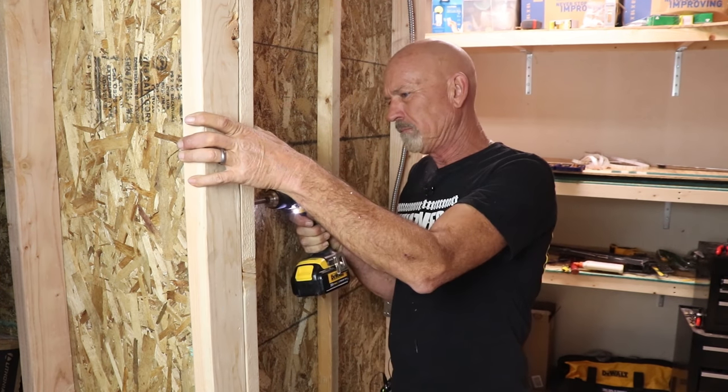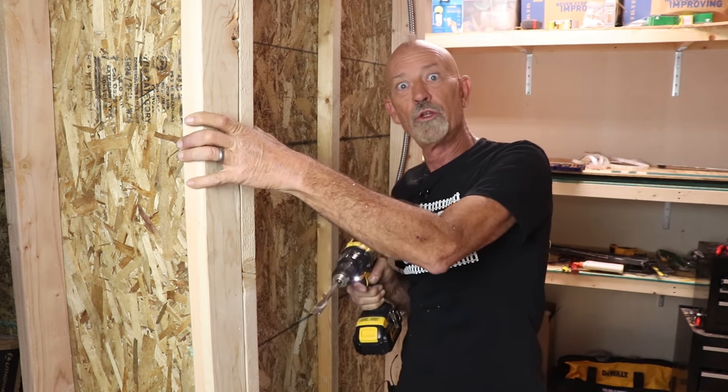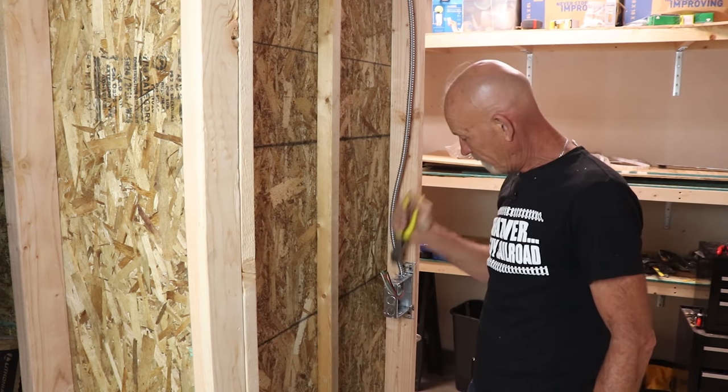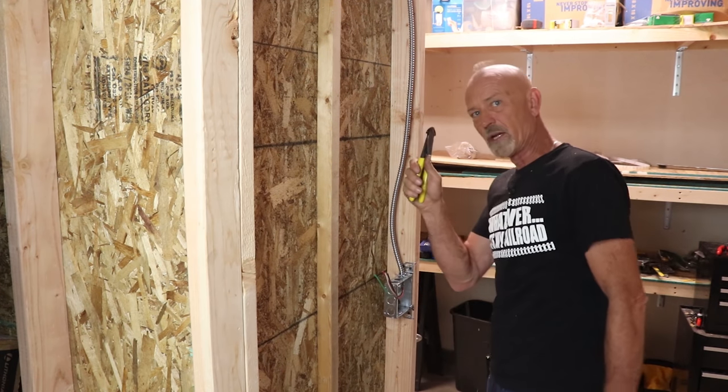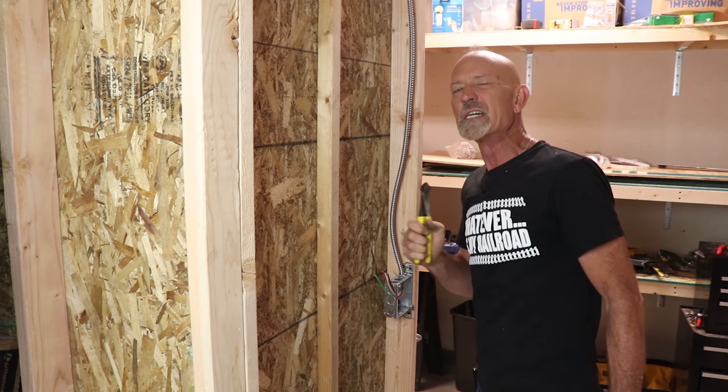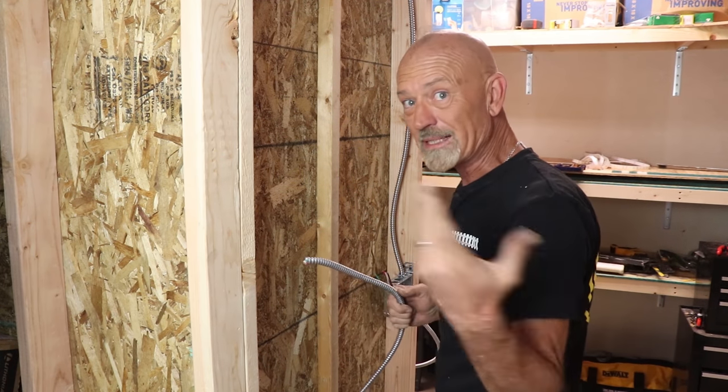One down. Two down. Just like you've seen us do before. Knock out the knockouts. Standard pair of dykes, just something to pound it in with, and grab a hold and break that sucker off, because that's how I rail, baby. And we're going to route some cable through it.